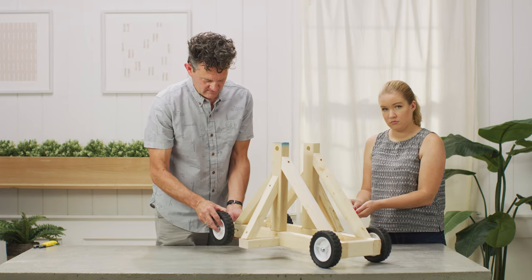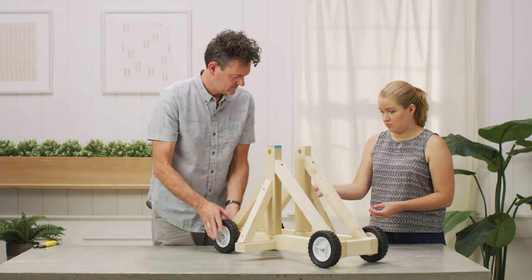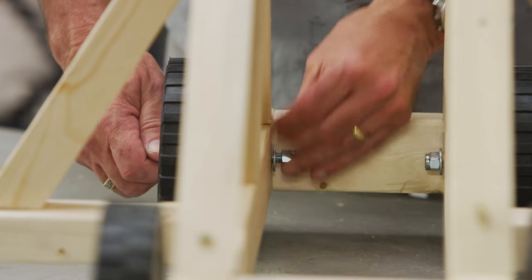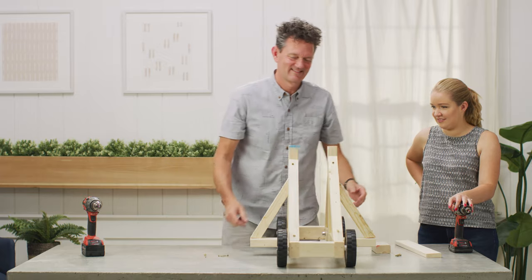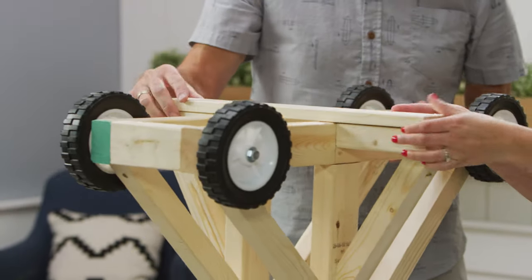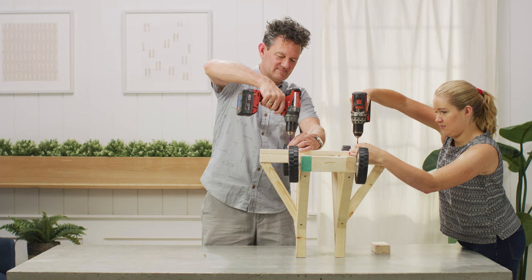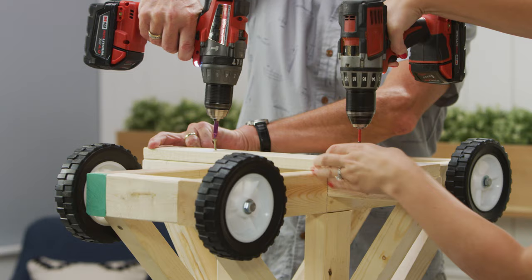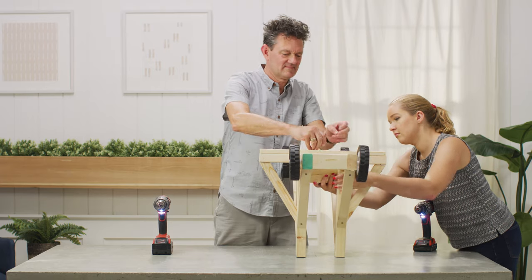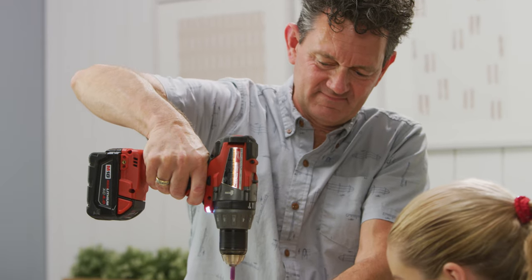Next, it's time to add the wheels. Mount them in place with bolts, washers, and nuts. Now mount a 20-inch 1x3 under the frame, screwing into the 6-inch pieces of 2x3. Fit your last 5-inch piece of 2x3 between the uprights and screw into place.